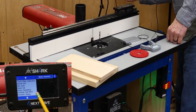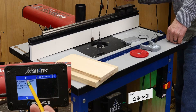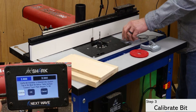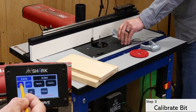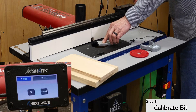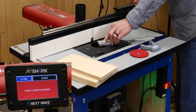Next, open the app menu and select the touch plate calibration and select bit calibration. Connect the magnet to the router bit or the collet and then click through to the white control button. Use the down button to lower the bit below the table. Click OK and touch the plate to the bit to verify that you have a good connection. Press OK to proceed with the bit calibration. The bit will raise up, touch the bottom of the plate, and then go back down below the table.